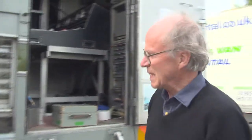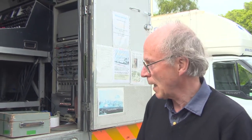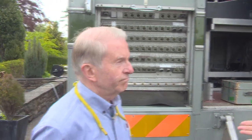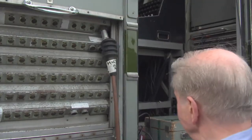Okay, well, I've had a look inside, and I think with the resources we've got available, we can have one lip mic with a commentator. Yes. And he will also have a stick mic in case he wants to do an interview or a piece to camera, something like that. Effects-wise, we've got a gun mic, so we can have an 816 gun mic on general effects for a crowd pickup, audience. And your little ECM50 microphone behind the dartboard to get the darts. So we've got one single mic cable for the communications.